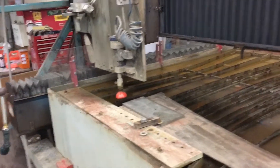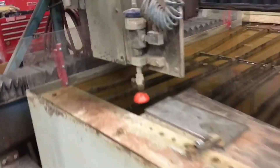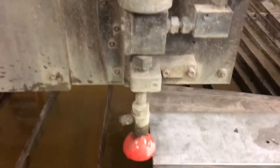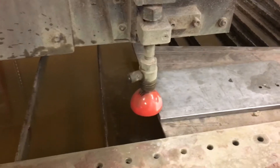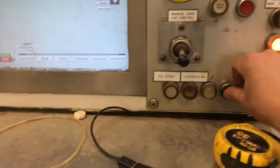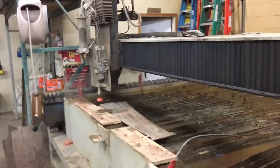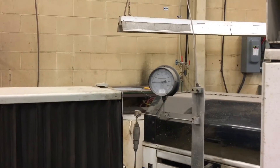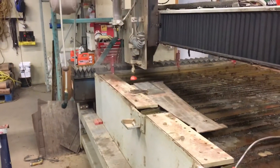This tip, when we went to start this waterjet up, it backfired out of here into the garnet feeder. So there's something jammed in this tip. What we're going to do is show you what it's doing. We're going to turn the intensifier on — it blows fine — then turn the water on, and the intensifier can pressurize. It would do the same at high or low pressure. When you click water jet on, you can see it's coming out the side.